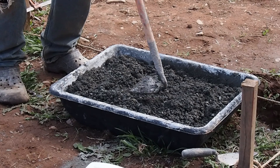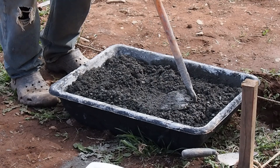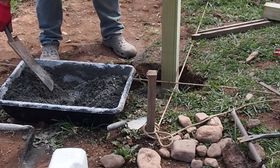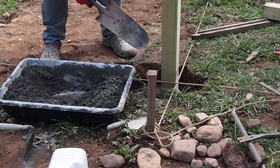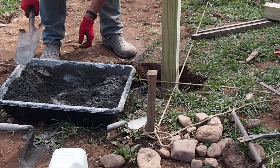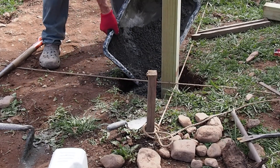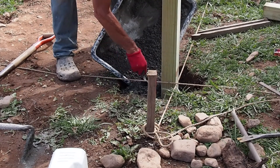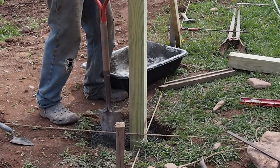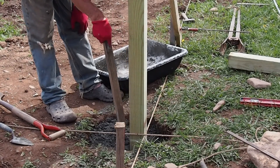This is not anything you're going to pack down and scratch your initials in — it just isn't that consistency of concrete. But this is the strongest mix you can do. A lot of times when you do it like this there'll be little pockets of dry powder, but they have enough moisture around them that when they get in the hole with all the rest of the concrete they'll hydrate and form up into a solid mass. So you don't need to dilute more and weaken your mix.